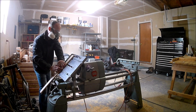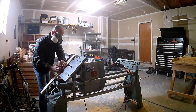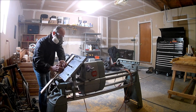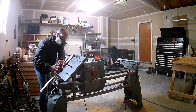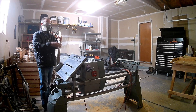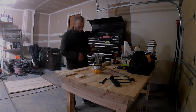Once it's set up you just run it through. You may see me sliding the board across the end of the table — that's just to make sure the board clears the end of the Shopsmith table so it doesn't snag on anything. For longer boards you have to slide everything to the end so it clears the table. I have a steady enough hand that I can incrementally move the board up until the cut is exactly at the corner of the board's end, giving a nice perfect 45 with the point right at the end.